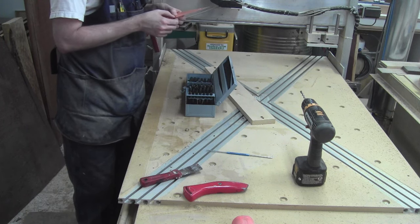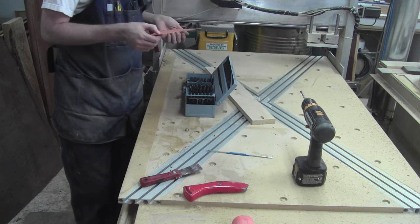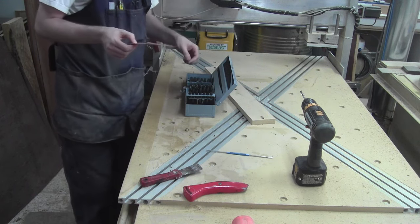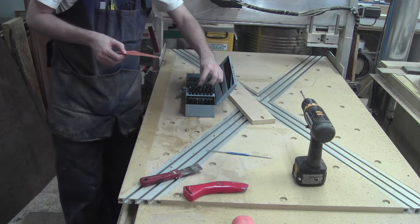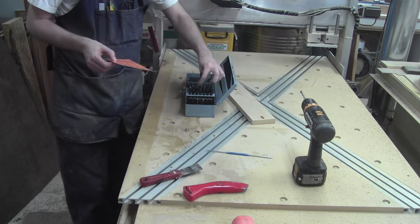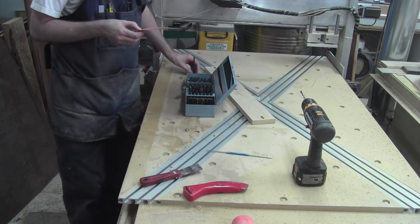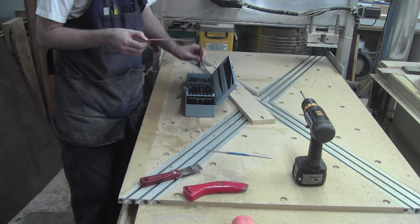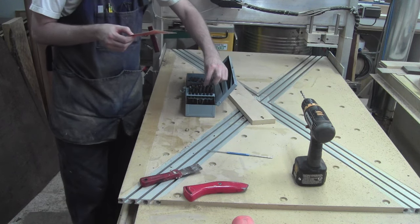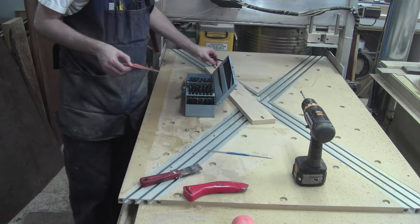It looks like F, 257, is my only next option. E is apparently exactly 250. And F being 257. Oh, you know what though? It can't be 250. It's got to be just higher than 260. So G is 261. That leaves me 1 thou of clearance. That might be perfect.